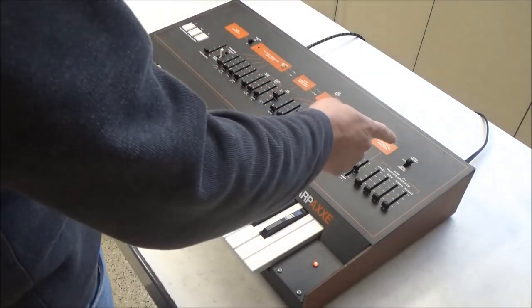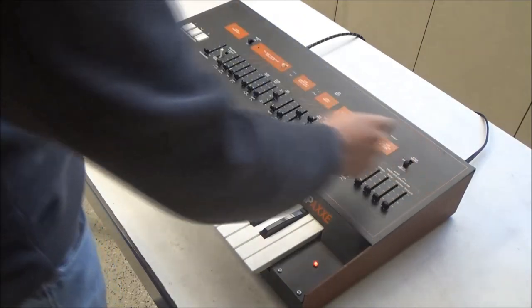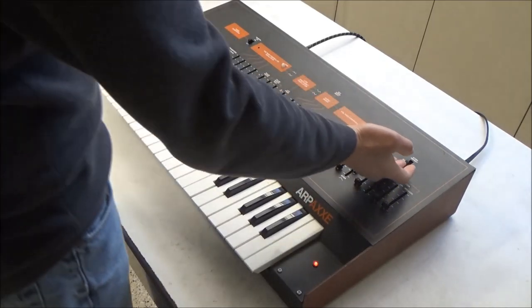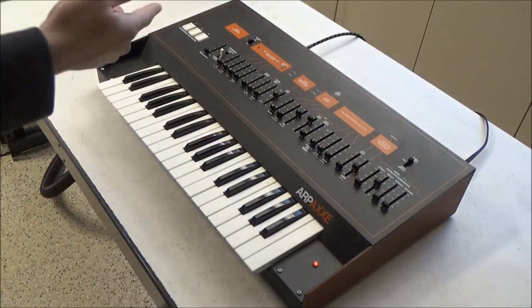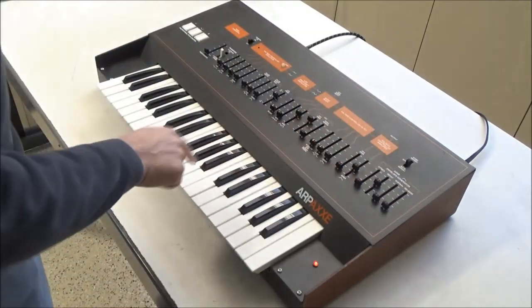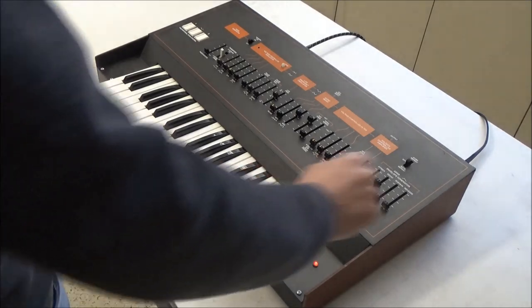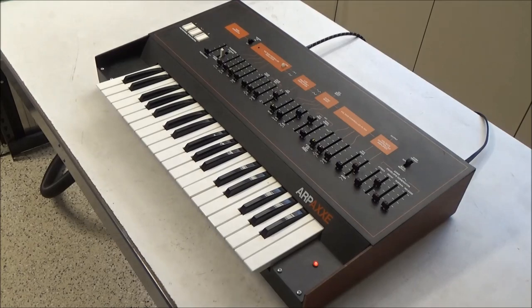The clue that it's a wire that's stuck is if I put this on auto repeat, it's doing that, which it should. But if I put it on keyboard repeat, it still plays a note over and over, when really it should only be doing that if you've got a key pressed down. So that's one issue, or two issues.